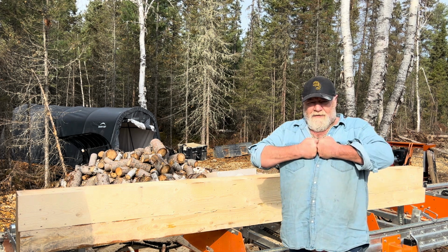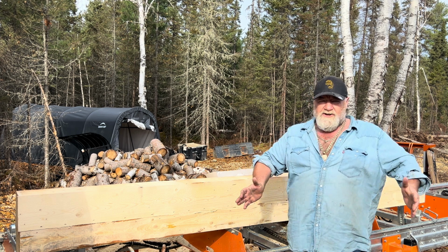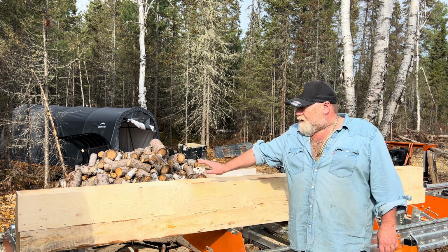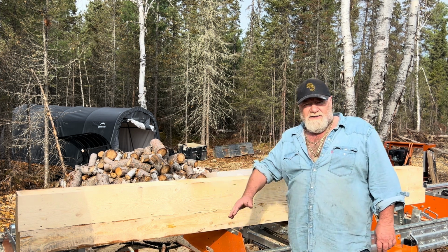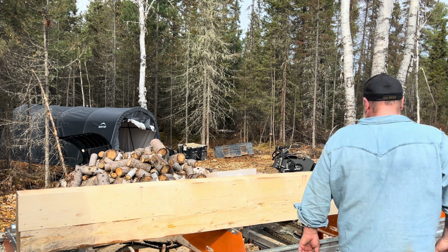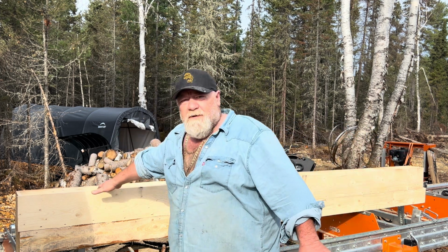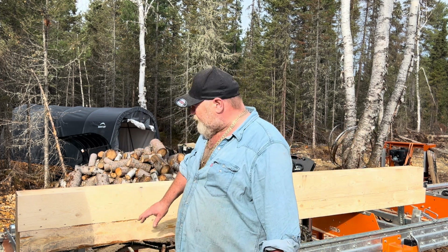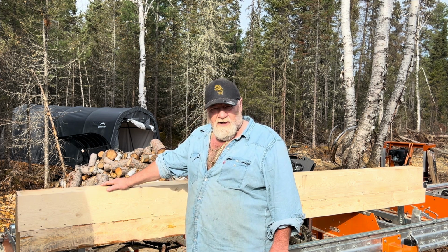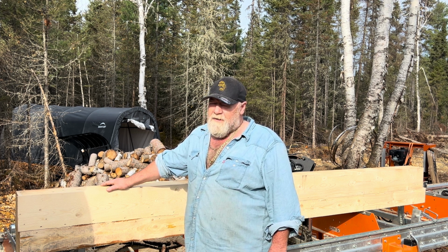I'm going to be butting them together right on the actual saddles on my 22 inch by 22 inch pillars that I poured. So this is going on top of that. All these are going to be going that way, that way, that way. And then my 30 foot by 40 foot subfloor will be built right directly on top of these. That's why I decided to go with 12 inch. It's solid, and it's going to take way more weight than the cabin that I'm building.